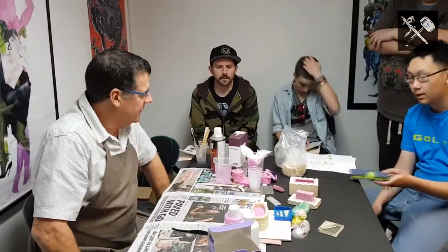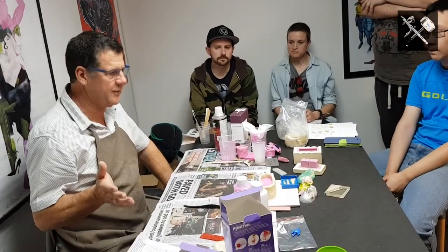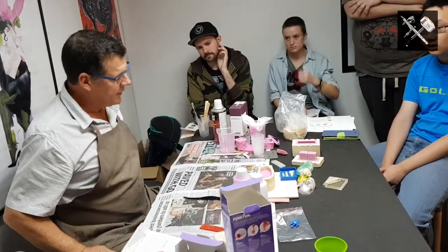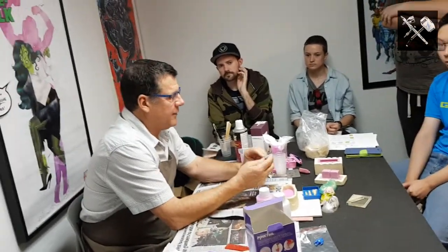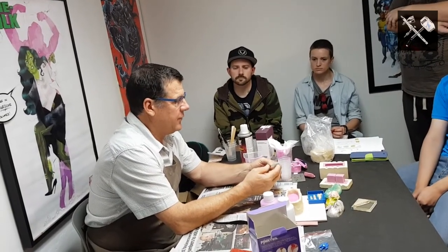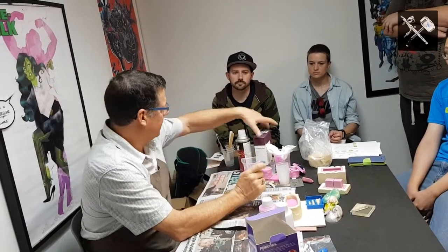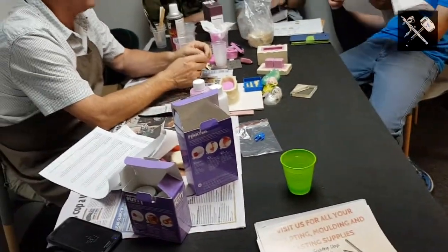The next thing to consider is the resins that we're going to cast in. Now we talked about epoxies, but one of the more common ones is polyurethanes. Polyurethanes come in a rigid finished product, either white or tan, or clear, and they also come in flexible. For the parts you're making, you use a product similar to your Easy Cast. Flexible polyurethane can actually be used for making a mould as well. We have customers that make railway sleepers and pavers, and they use polyurethane.